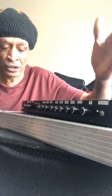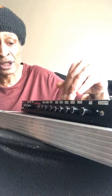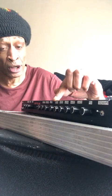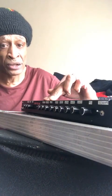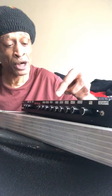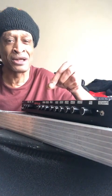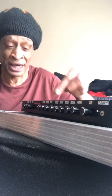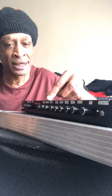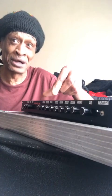I'll come back to that in a second. For each knob, you have 5 bands in the sub frequency from 25 Hertz to 60 Hertz. And then you have 3 bands in the upper frequency, and it's been widened due to myself and a couple of sound men chatting. It's been widened, so it's from 70 Hertz to 125 Hertz for the upper bass, to give it that little extra oomph in the depth of the kick section. So it was widened from 80 to 70. So that section actually sounds very nice, I have to say.